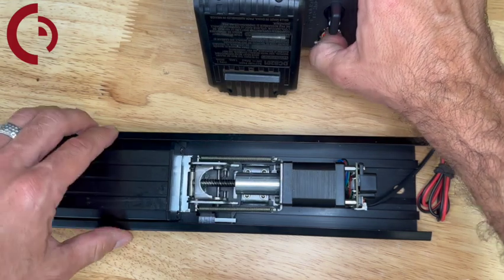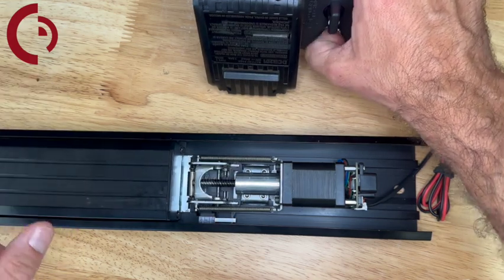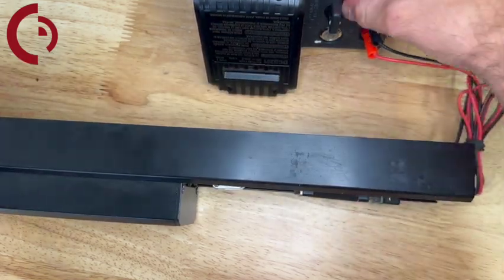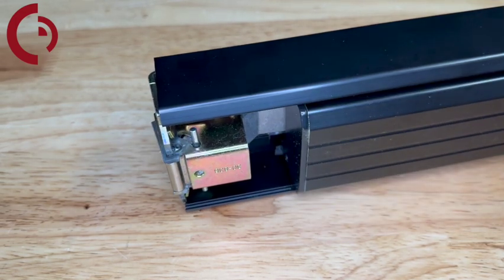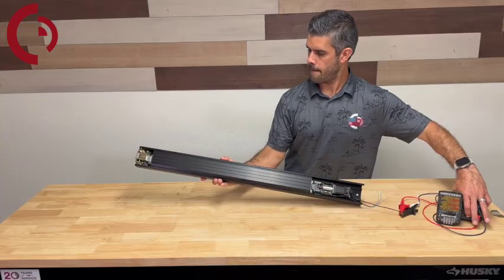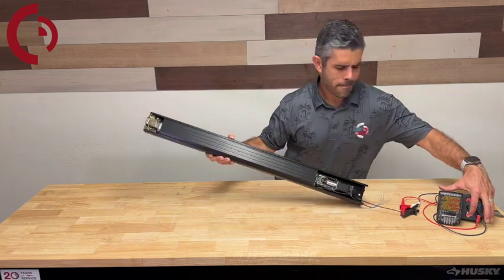Next I'm going to test it out, make sure it's the right location, and fire it off a few times to make sure the latch is coming in all the way. If it's not to my desired location I can start the process over again. For a real life scenario we'll turn the device on its side to make sure the push pad releases all the way. Now that we've confirmed the device is retracting to the desired location and everything is working properly — that, my friends, is another successful installation.